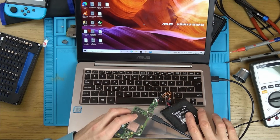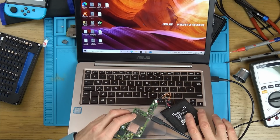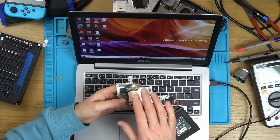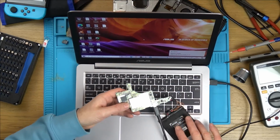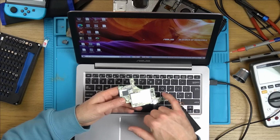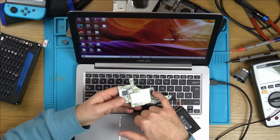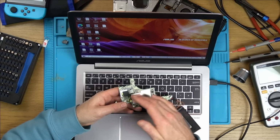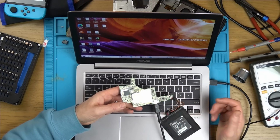Now, I don't know what APX is, but I've just Googled Nintendo Switch APX, and every single result so far is to do with, you know, Tegra this, or hacks this, or patch switch this, that, and the other. So, yeah, right now, this is the problem I've got. This is why I hate stuff like this. Is this faulty because it's got a hardware issue on here? There you go, APX is set up and ready to go. Is it faulty because something's gone on here? For example, that charge chip there, that one up there, although there's no shorts around it, I've had it once in the past where it was still faulty. So I could swap that out and then it might fix the problem. Or is this to do with something being done incorrectly when it's been hacked and now this is bricked, like software bricked?